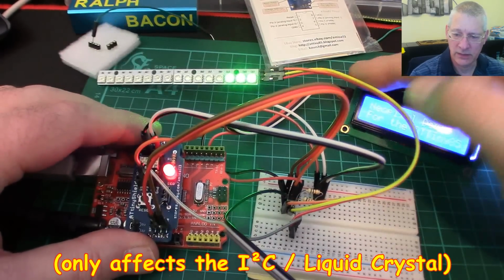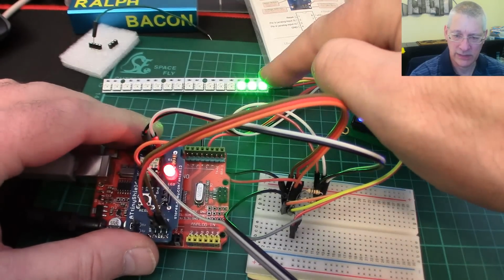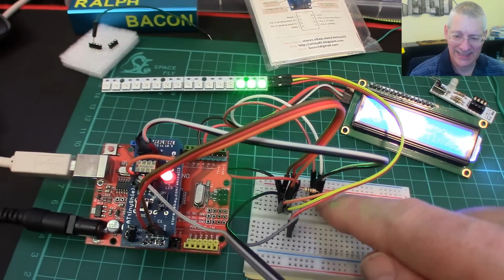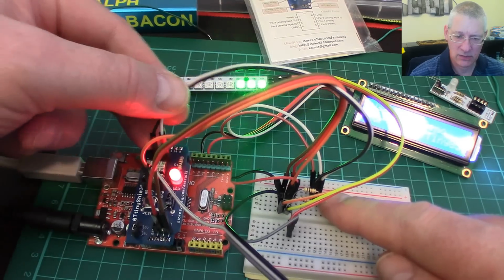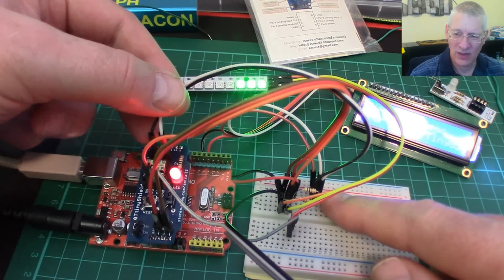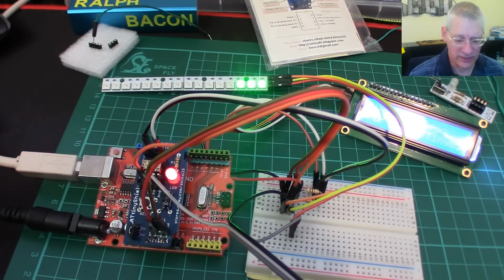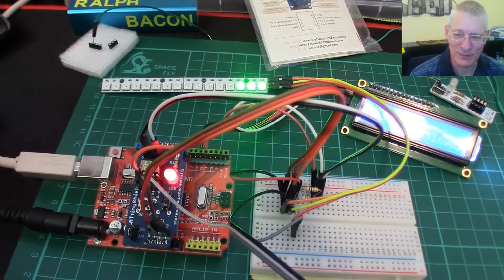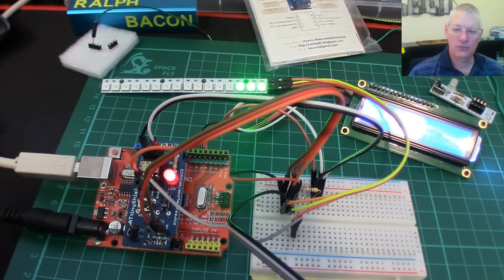So basically this thing here. If you're not worried about that, it will still carry on. You do need some pull-up resistors, it says, on those two lines, the SDA and SCL for I2C, although I must admit it did work for me both with and without. I only put them in because things started to go wrong, but that was a totally different problem, a hardware problem, nothing to do with this. Now, okay, final judgment then really.